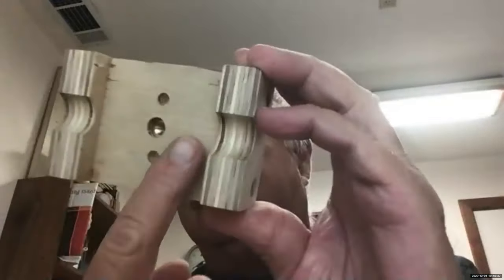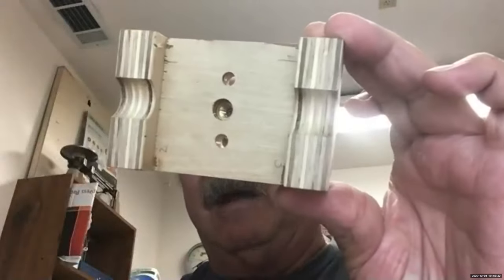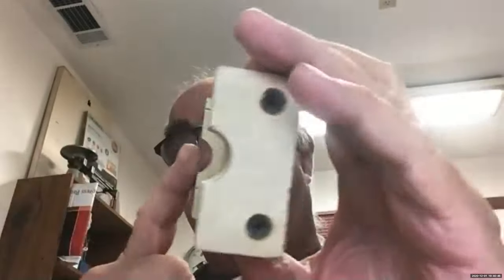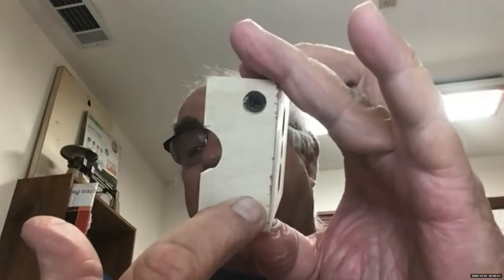For this guy, the reason he asked me to build things — no matter how simple — this is as simple as it gets. The piece in the center is just two-and-a-half inches square, and the two end pieces are the other two-and-a-half inches. You start by cutting a three-quarter inch hole in the center, then countersink a couple of areas for screws to screw in the blocks.